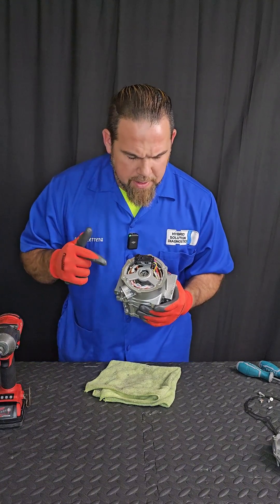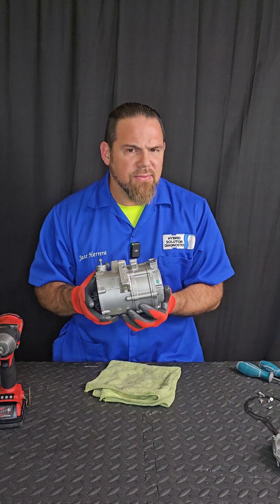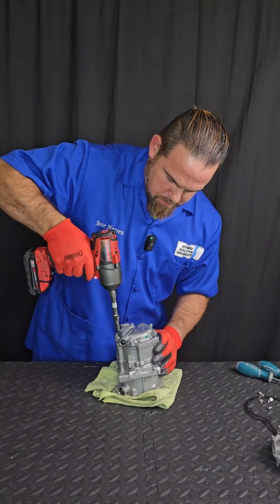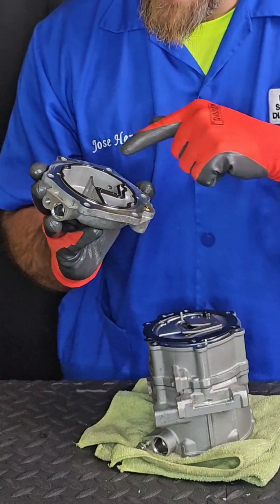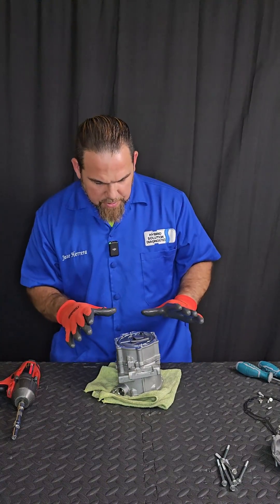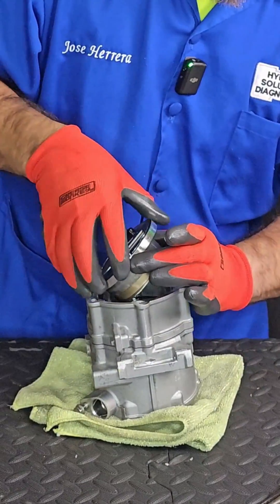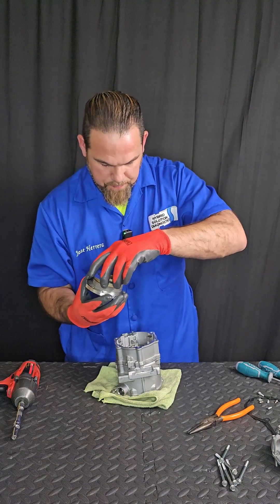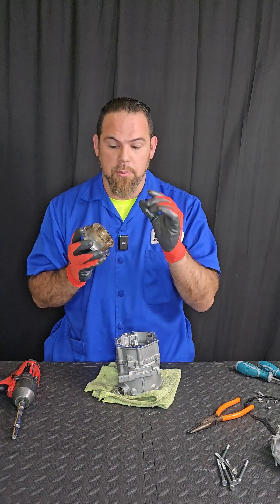One of the things that made me very suspicious is I'm not seeing the system contaminated inside. And the other thing that really surprised me is that this compressor is actually made by Panasonic Corporation — it's Japanese. So why are these compressors failing so early? Let's open it up. The first component I'm going to take out is the main cover, and the main cover in the high-pressure system looks completely uncontaminated to me, which is a good sign. What we're seeing over here is the flapper valve, so I'm going to have to extract it very carefully. This is the scroll. Now, remember, this type of compressor doesn't use regular pistons — they use a scroll-type compressor. In other words, the movement is eccentric. This is how these compressors work.